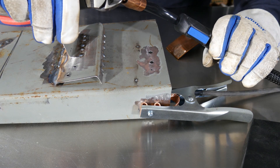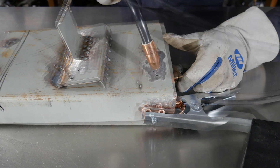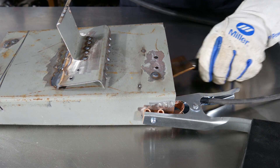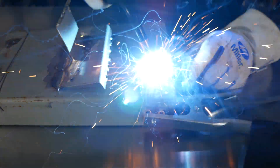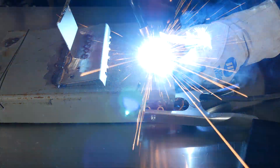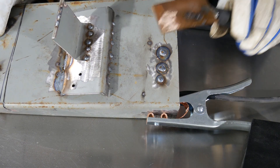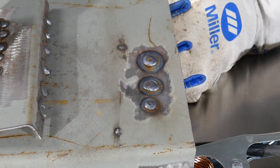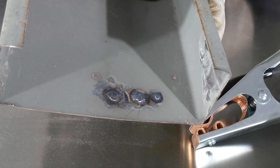Trim the stick out. Basically all we want to do is hold our welding spoon back here and fill the weld. For the bigger holes, you really don't do anything different except you may want to work the sides of those welds first. You can see my spoon stuck to my weld, but it just pops right off — it really didn't stick to it. You can see those holes are nice and filled up. Now we can grind those down and we don't have to fill that with body filler. You can even see the back sides of our welds — we've got good penetration there. Those holes are filled up and we've got some structure there as well.